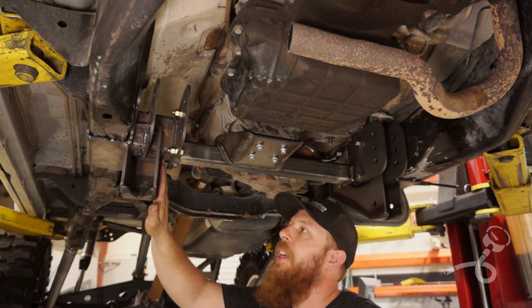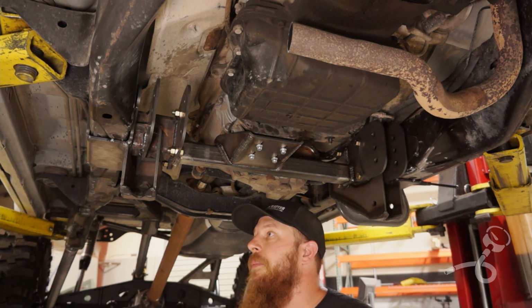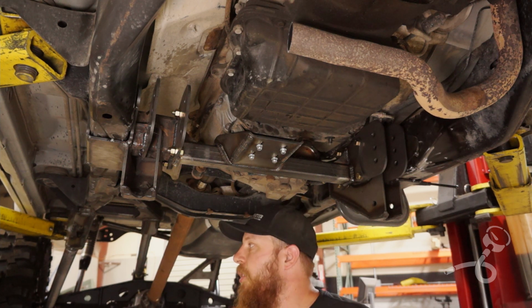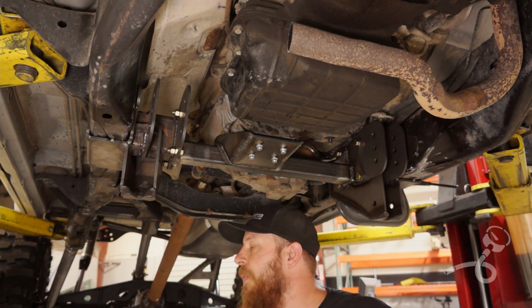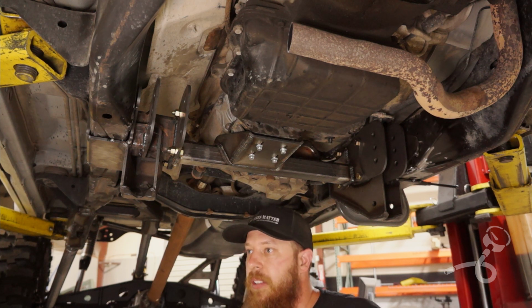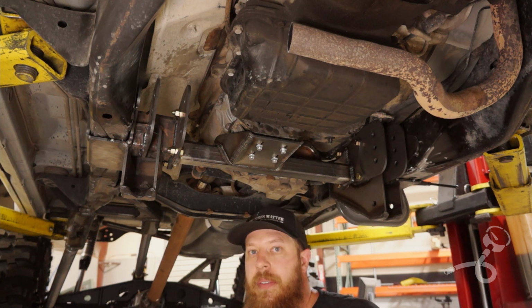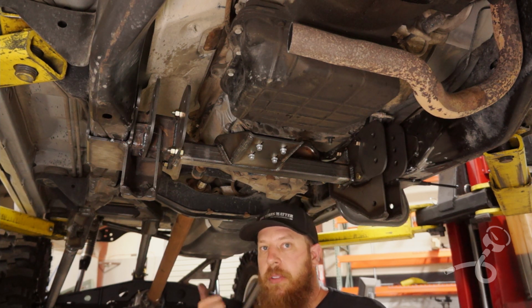Pretty excited about that. So now it's time to finish the front axle widening, and it's time to weld some link mounts to that and then get these uppers and lowers onto the axle. Then it's track bar, shocks, and steering, and this thing will be at least able to move around. So I think I'll probably call it here, and I'll probably just do an outro out there.